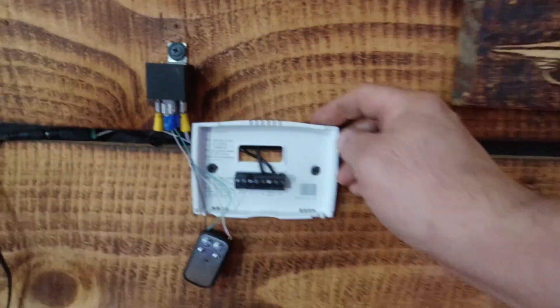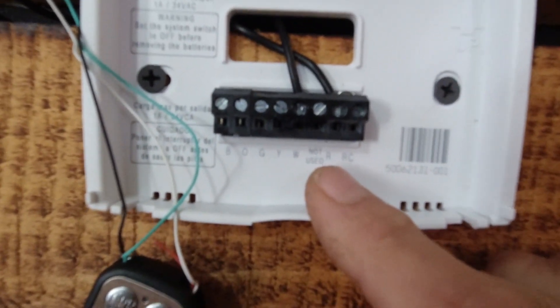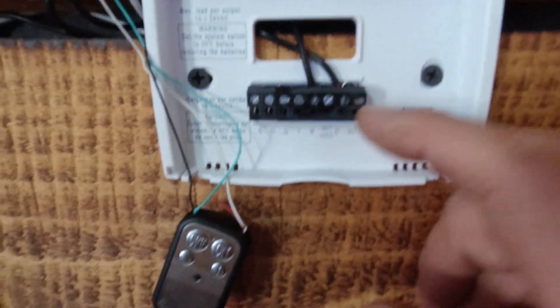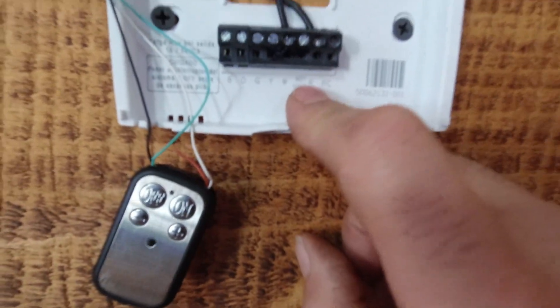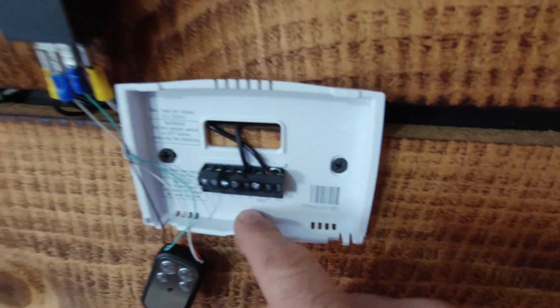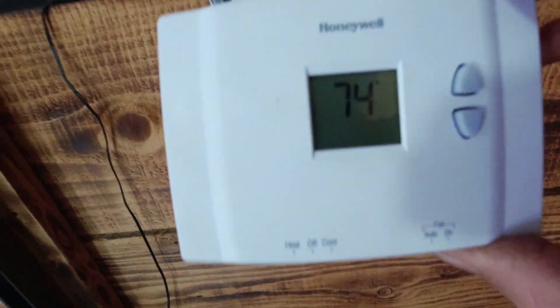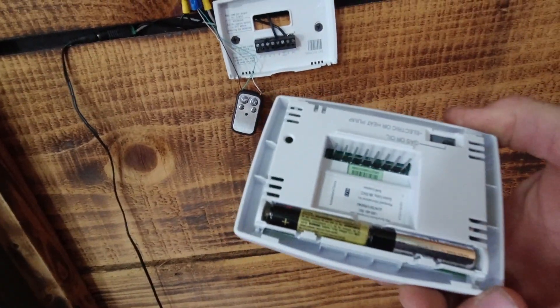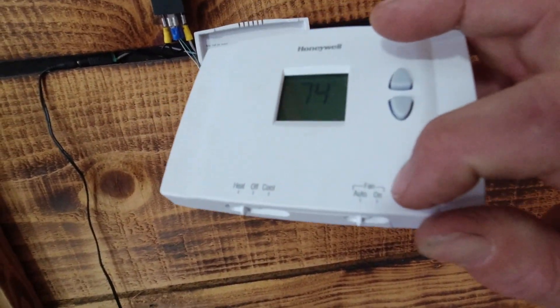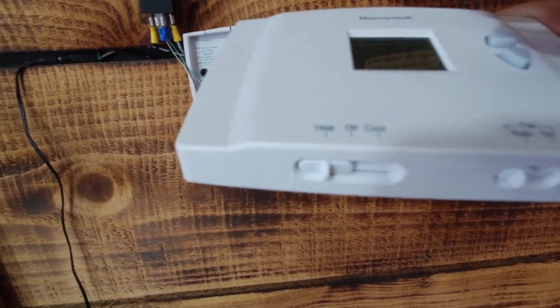So how did I do this? In the thermostat itself, the only wires actually hooked up are the R and W. The R and RC are connected with the jumper already, and the W — it just skips one marked 'not used' — those are the only two connections you have to make inside the thermostat. The thermostat has its own battery so it stays on even when taken off the wall. I have the switch set to gas or oil, the fan on auto, and of course heat.